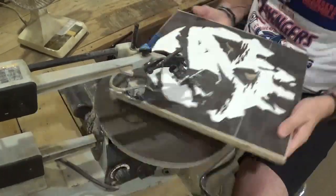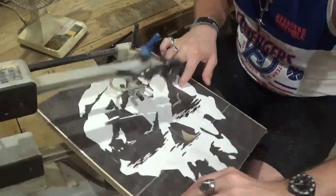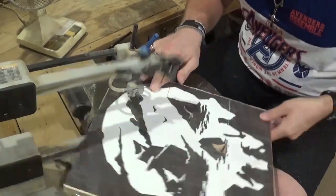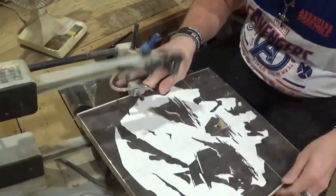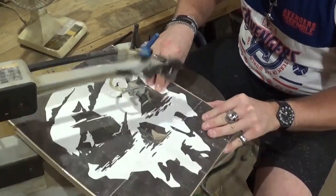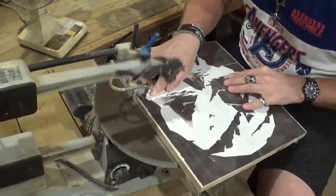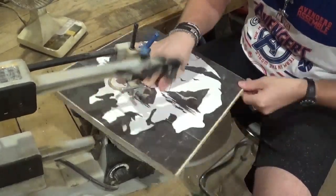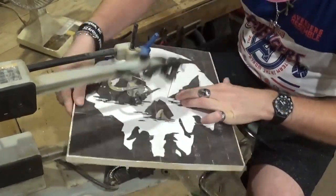Even though this is palletwood, I am using number five reverse tooth shark tooth scroll saw blades. How cool is that — using a shark tooth blade to cut out a pirate-themed project! The wood measures about three quarter inches thick, and I really took my time sanding the back side of this piece to get it nice and smooth so it would ride on the scroll saw table nice and smoothly.